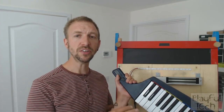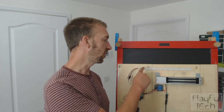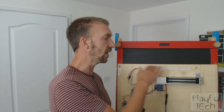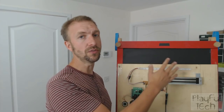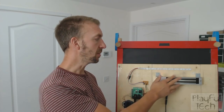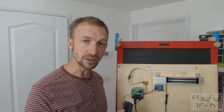If the player presses the correct note for the next note in the melody, it's going to light one of these LEDs up here green in a row, and when all of the LEDs have been lit up, the mag lock here is going to be released. That's the idea — let me show you it in action.